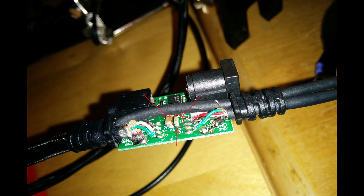Everything works fine without it. We replaced it anyway with a generic 104 ceramic cap just to provide some basic DC ripple filtering, which was probably the intended purpose for that component. Camera battery finally died for good so I've got no celebration shots. But I put a little bit of epoxy on those solder joints to provide some strength, closed it all up again, and that's it for today. Thanks for watching.